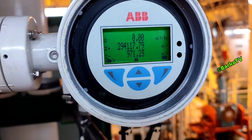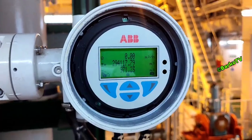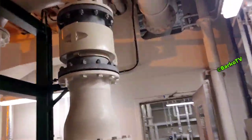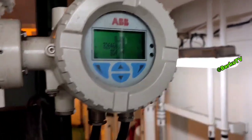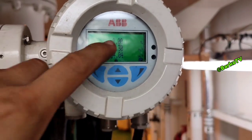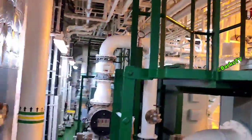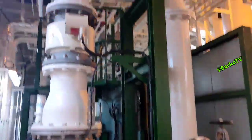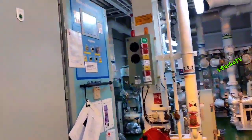We check the actual signal going to the PLC and at the HMI. I also show the port side — the same signal is zero going to the PLC. That is the port side. On the starboard side, we already installed the new cartridge, and now we will check at the HMI.